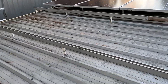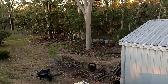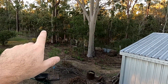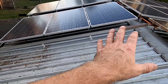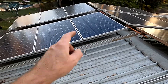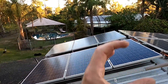We have now mounted both rails — everything is tightened. The solar panels are up here and the rail system is ready so we can mount them any time. The clamps were delivered this week. I do need to replace some clamps over there because these are only 35 millimeters but it's a 40 millimeter panel — the bracket is just sitting at an angle now.